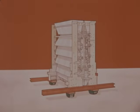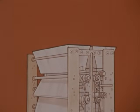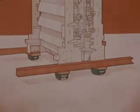When moving top-heavy loads, the use of outriggers will prevent the load from tipping over. If in doubt whether the load is top-heavy or not, it probably is, so use outriggers to be safe. If the load has a water or oil reservoir on top, drain it to reduce the weight and lower the center of gravity. The outriggers should be secured to each end of the load and long enough so that the load will not tip should a roller skid or dolly be lost.